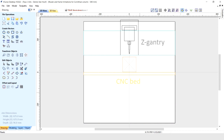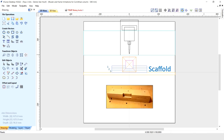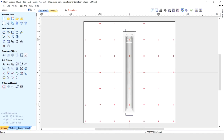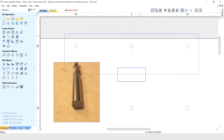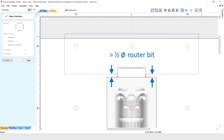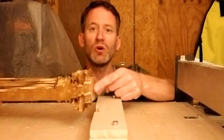When looking at it from the bottom of the column, I positioned the keys in the exact center of the top and the bottom. These keys could then rest in pockets carved in a scaffold of three MDF panels stacked together. I designed the locks 0.1mm wider than the keys for a tight fit, and left a 2mm space above and below the stock for some wiggle room. The scaffold for the locks was placed at the opposite ends of the 3D column, using the left and right holes to secure the locks onto the CNC bed and the center holes to clamp the stock. Keeping in mind that router bits are cylindrical, I also added fillets in the corners of the locks so that the keys would fit all the way in. Once done, you can rotate the keys of the stock inside these locks for a full 360 degrees in increments of 90 degrees.